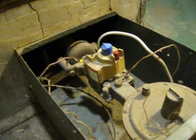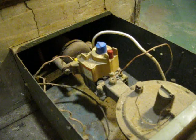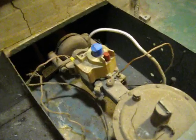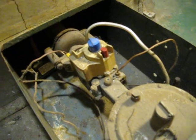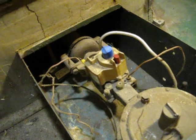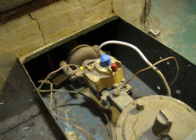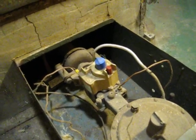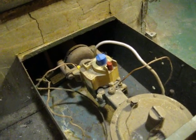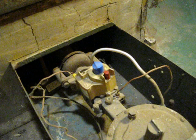The clicking reduces in frequency once the pilot light's lit, which it is now. That copper wire right there — you can see it comes out right below that red button — that's the thermocouple wire. That's what lets the burner control know that the pilot light or the main burner are on. So if the light goes off, the burner shuts down. The blue knob has three positions: off, pilot, and on. Right now it's on.